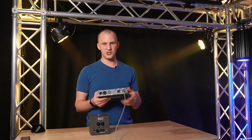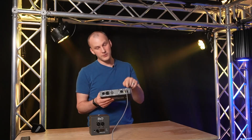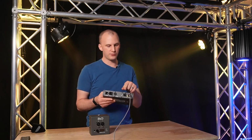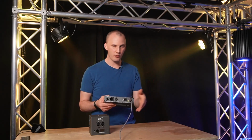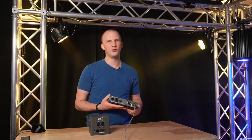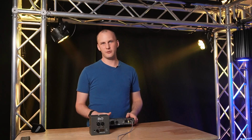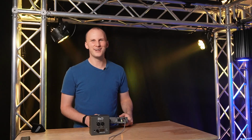That's not possible engineering wise because this is a network switch, so basically it would have to power the network switch by PoE and then push out enough power to power more nodes, and then the issue there would be people would try to chain a ton of nodes together. You wouldn't have enough PoE power on the port from your switch or router. It's just a bad idea. Okay, so I apologize for that in the past because that comes up from time to time.